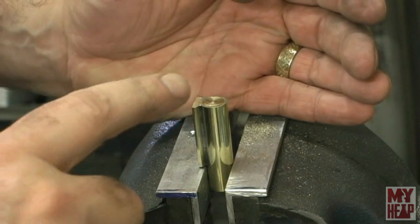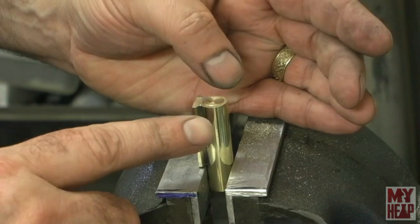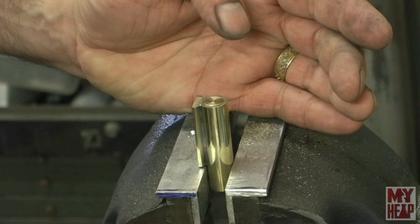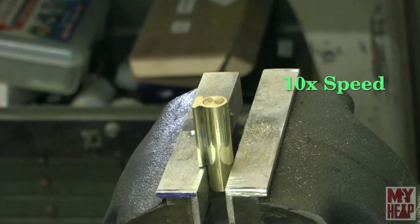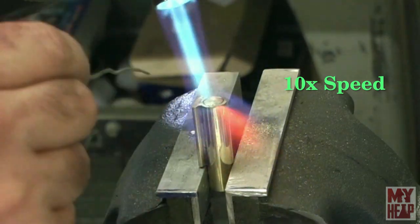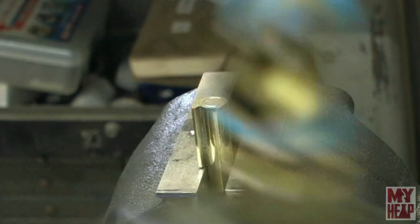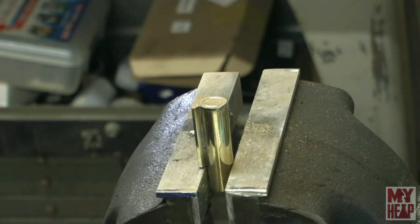Okay, so the cylinder cap, the cylinder end, is pushed into the bore and it's flush with the top. Got a little bit of flux on there. So let's get some gas on there and get it soldered on. So that's soldered in. I'll let that cool and I'll clean that back up and I'll bring you back in. We'll look at the prints. I think we only have to put a steam hole in. So I'll bring you back in just a minute.